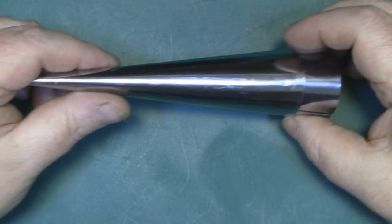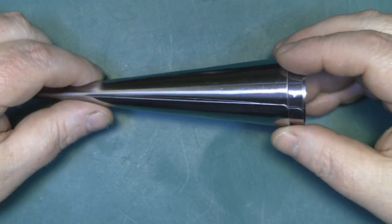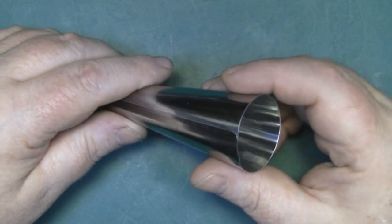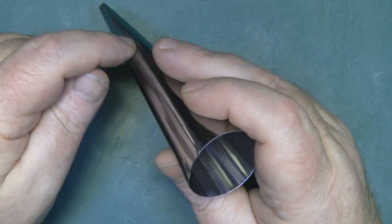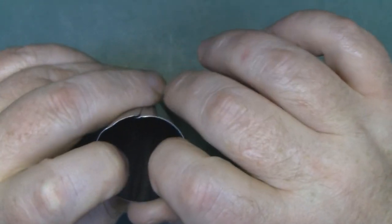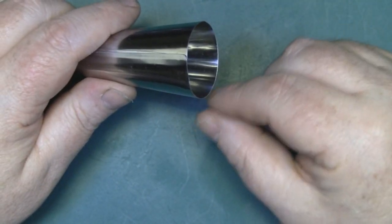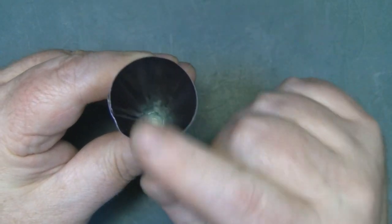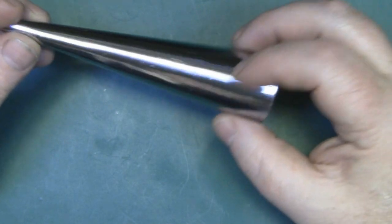To help you make this antenna, you're going to need to get some cream horn molds. I'll put a link in the description to a seller on eBay — they're pretty cheap, I got six for around five pounds. What's really good about these is they are stainless steel but not fastened down the seam, so you can pinch the diameter in or pull it apart slightly. You can put a jubilee clip around it to reduce it to the circumference you want.